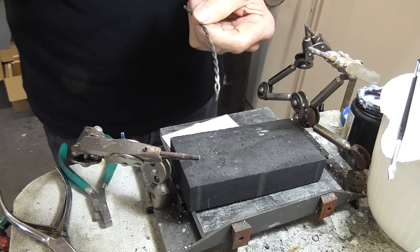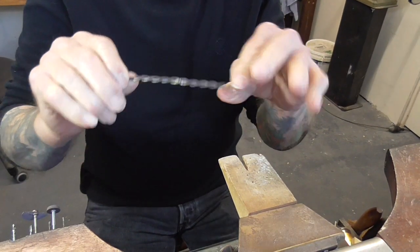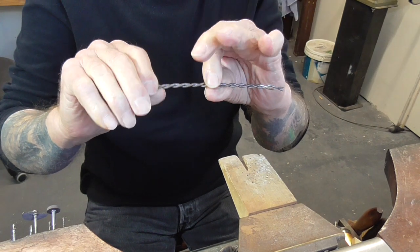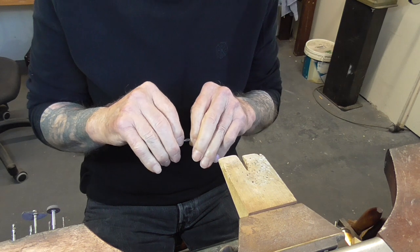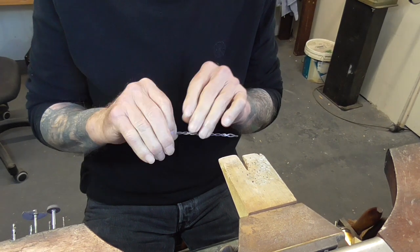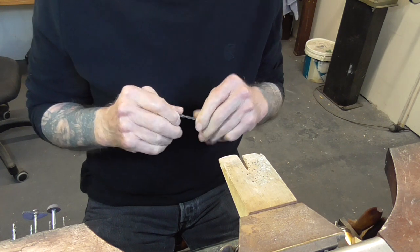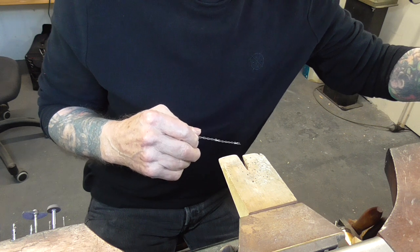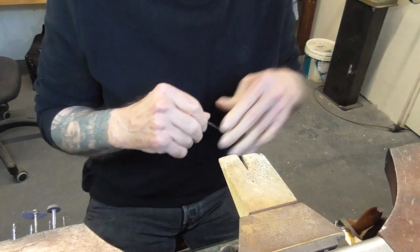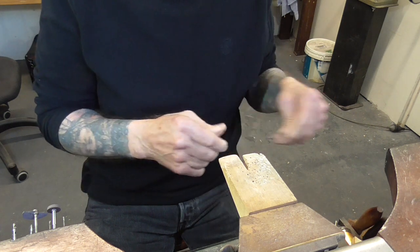Now we'll dry this. So my material at this point is 3 millimeters high. So inside diameter of your ring plus 3 times 3.14 will give you the length. Now I'm going to make a P, and it will end up being 66 millimeters long.